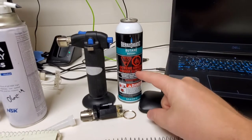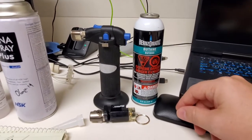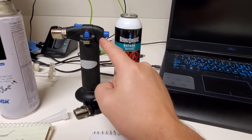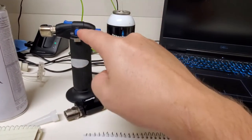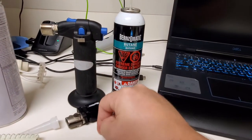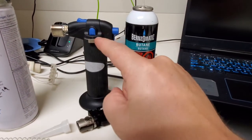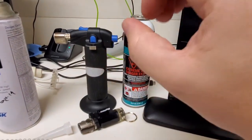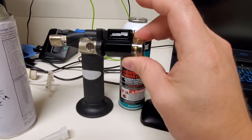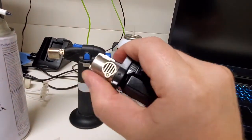A lot of biomeds are going to criticize me about this one, but there are times when an open flame in and around a hospital is going to be a good thing and save you a lot of time. This torch lives on my bench. If you need to expand a piece of metal, work out a fastener that's stuck or broke off, a torch comes in handy. We also use it for stripping back insulation, heating up hose so it softens to get over a hose barb — there are so many uses for a torch.